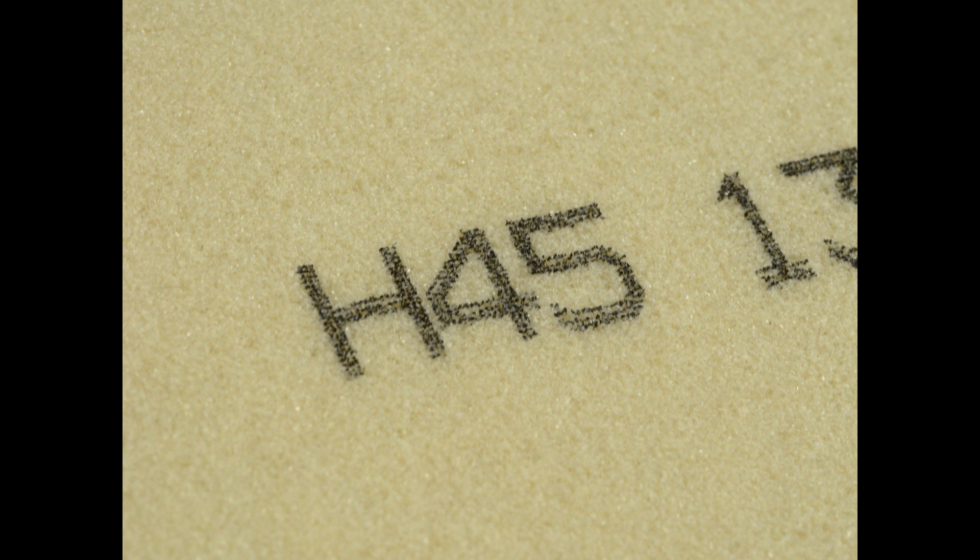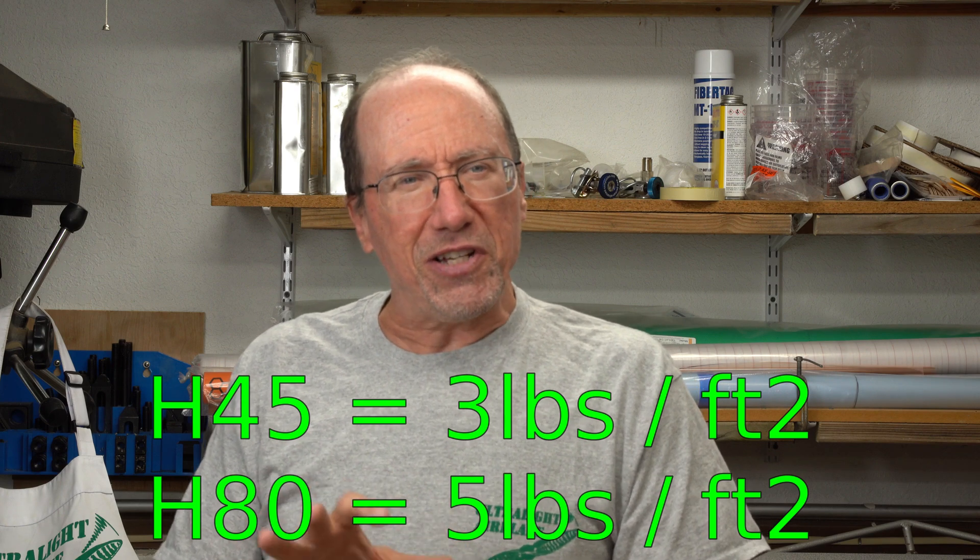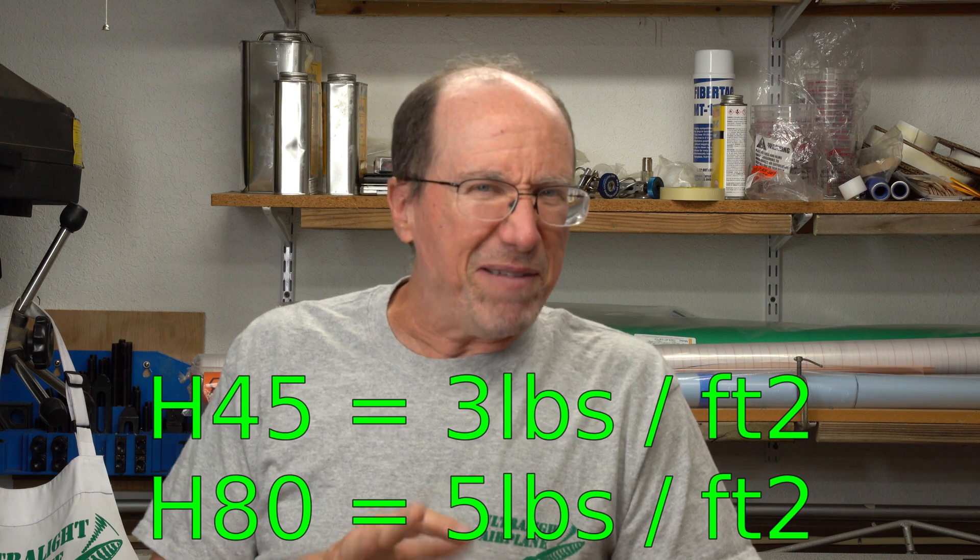One of the things I learned is that when you're using a foam core — especially thinner foam core, say an eighth of an inch to a quarter of an inch (about three to six millimeters) — if you're using Divinycell H45, the final weight once you've done your infusion will be almost the same as if you had used H80. The H45 cells are bigger than the H80 cells, meaning the surface of an H45 piece of foam will absorb more epoxy than H80. H80 also has far better physical characteristics — better shear strength than H45. So I'm going to do an experiment to verify that.